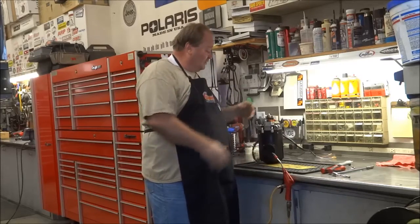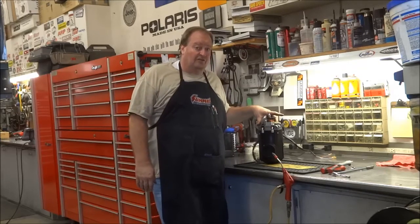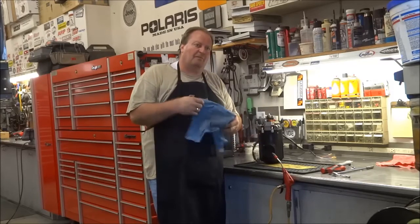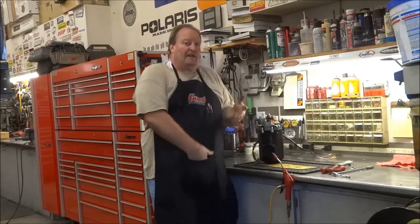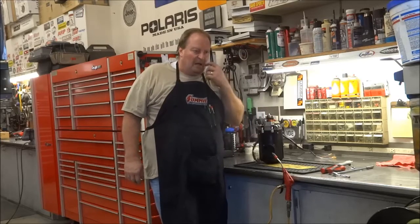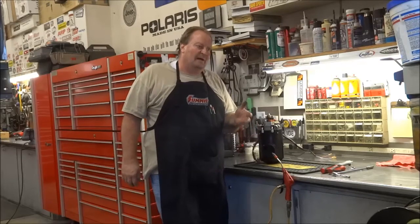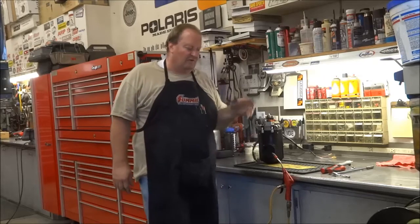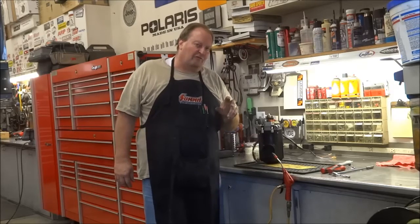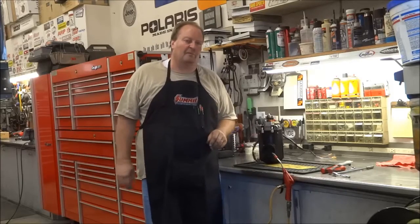I thought I'd go ahead and make a video. What this is, is the Webasto burner out of the AquaHot system on our 2003 Monaco Dynasty motor coach. A couple months ago on a previous segment, I showed the general routine maintenance of changing the filter and the nozzle because I was getting a little bit of smoking. Over the course of the summer, the smoking hasn't really changed. It smokes initially when you first fire it up - there's about a 45-second to a minute gap, and then it'll puff just a little bit of white smoke for approximately a minute, then it cleans up and it's crystal clear the rest of the 15-20 minute burn cycle.